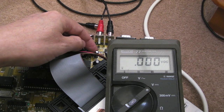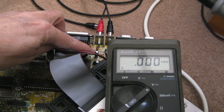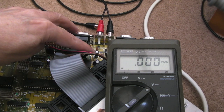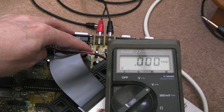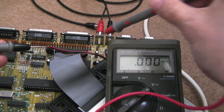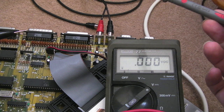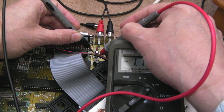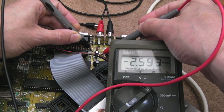It might make more sense if we scope it in a sec. The benefit of that is you then don't have negative cycles affecting that cap in any kind of adverse way, from what I understand. It seems like a common practice technique of biasing the input before the coupling cap — a cheap and cheerful way of dealing with it. It's just a question of whether it occasionally just dips to a very low voltage on the negative side, and I think it probably does to a small degree, because Jan evidenced that himself on his own video. So yeah, there was a mistake there in terms of not comparing like for like, and also I wasn't aware of this bias and the benefit to that — the reason why he would do that, and the reason why Commodore did that.